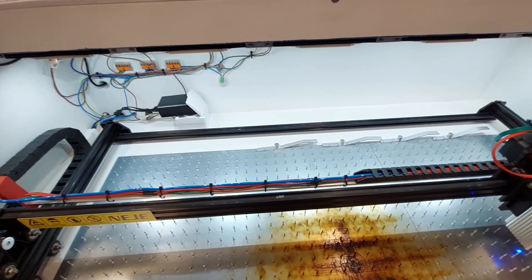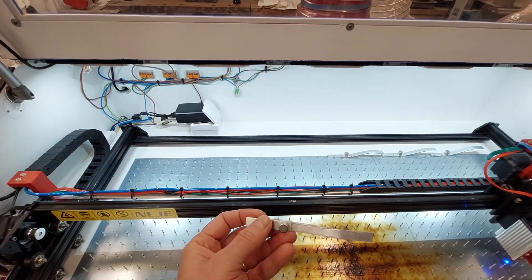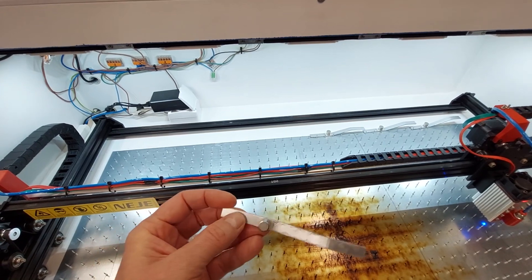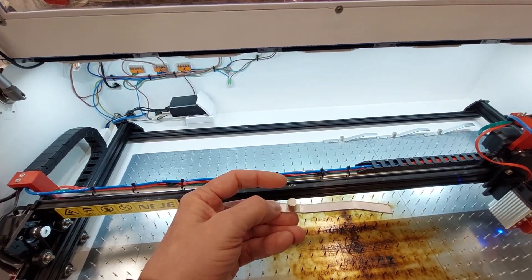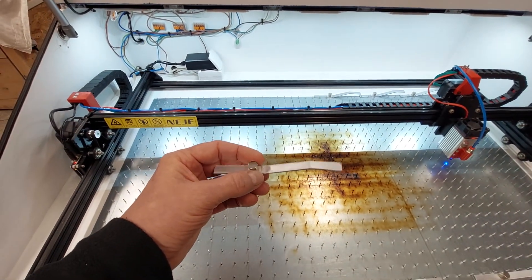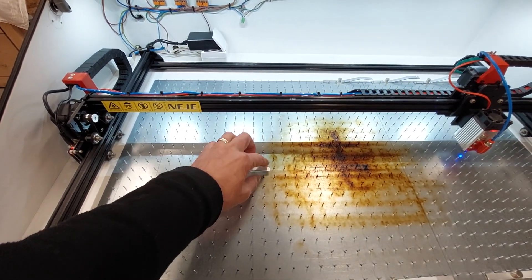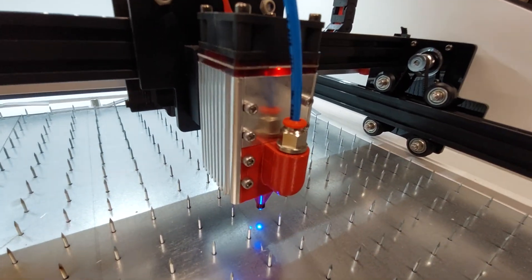A couple of additional features I use on my laser cutting machine: these brackets are a simple strip of two-millimeter-thick aluminum, about 12 centimeters long, properly bent. Using double-sided sticky tape, a neodymium magnet — 10 millimeters diameter, 10 millimeters high — is fixed to it. Since my laser bed is made of ferrous sheet metal, the bracket simply clicks on and holds the raw material in place.